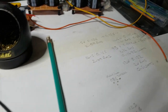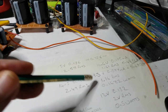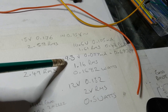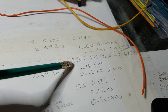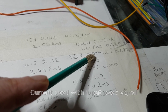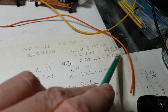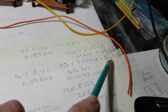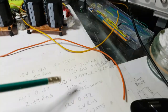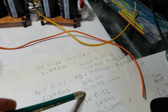So basically, here are the calculations. I started off at 9.3 volts because when you get a 9-volt battery it's higher than 9 - you get like 9.5 or 9.6 - so I went for the middle: 9.3. That's the current draw on the power supply at that voltage, and I just multiplied those two together. So we're using that amount of power to get 1.16 volts RMS into the oscilloscope, which gives us 0.1682 watts. And that's just on one channel, so two channels times by two.